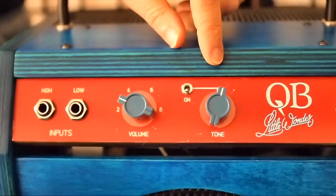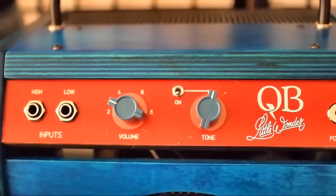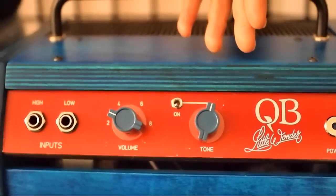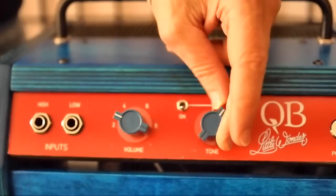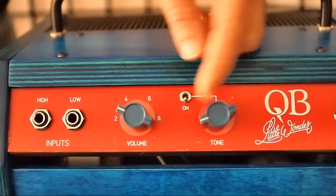The single tone control is quite a departure from the treble cut only single tone controls found on many early amps. This is a blend between high-pass and low-pass filters, so you get this continuously variable sweep across the range of the control. For everything from surf guitar to jazz, you can quickly dial in the sound you need for any guitar with this tone control.